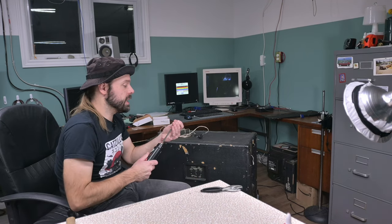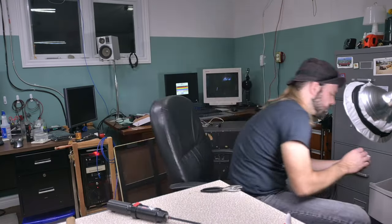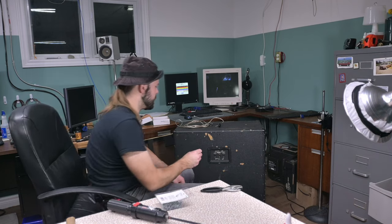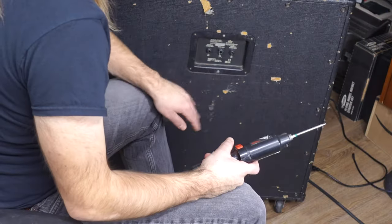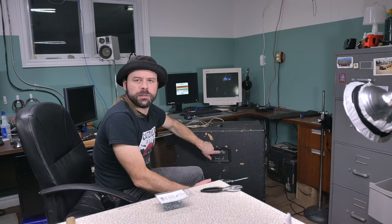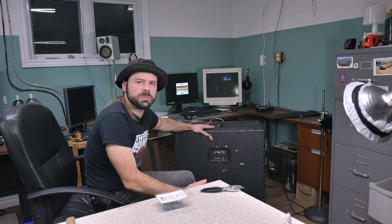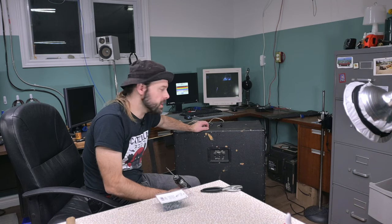It's kind of a hack job, but I know he'll appreciate it. This plate has been a bit deformed — I should have sorted that out before putting this all back together. That's okay, I can clamp my vice on sideways. Try not to smash too hard on a speaker cab — you don't want to screw up your magnets. There we go, that sits nice now. We'll trim off the excess, and she'll be okay. Now I'll put one of the only original screws left back in. Number six screws — those fit nicely. I'll put a fresh set of screws in once I've fixed that connection, and the cab should be good. He said he disconnected the reverb unit because it was giving him some form of grief, and it's been a while so he can't remember why.